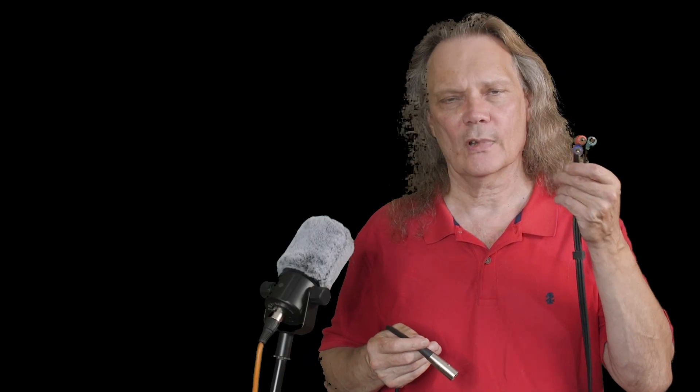Do the pro connectors sound better? No, they both sound the same — they're both excellent. We know that because you can find audiophile-level home audio systems that sound great and they use RCA pin connections. So what's the difference between these two, and why do the pros choose XLR? It all comes down to this style cable's ability to reject environmental hum and noise, which is greater than the RCA cable.